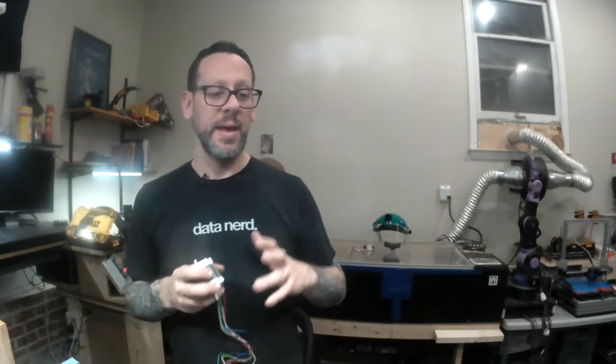And the stepper motor is going to turn a screw, and the screw is going to perform a lot of the lathe movements that we just saw. So as I'm turning the hand wheels on the lathe, this motor is going to be doing a lot of that and is ultimately going to be computer controlled. So lots of precision and lots of 3D geometry that we can start to cut onto cylindrical stocks.